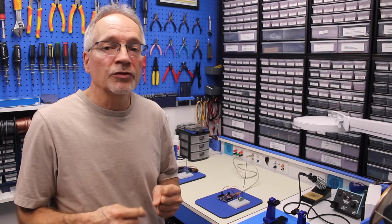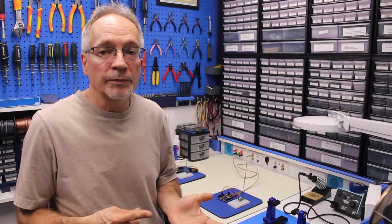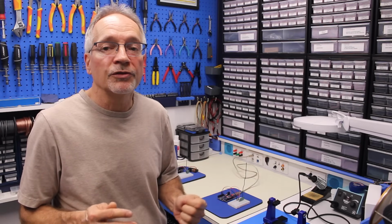And I can also experiment with doing things like coiling my wire. I can maybe make it a different length or something. Maybe add another 17 centimeter wire onto the ground. That is another common way of creating an antenna with two wires, one on the ground and one on the antenna side. So you can do some experimenting to find out the maximum range and also find possible sources of interference in your home.